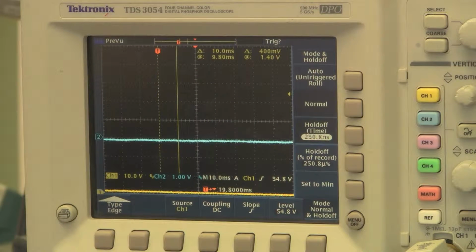I will now be going over the ThunderBox over and under voltage emergency stop tests. For this engineering requirement, we have to be able to detect the ThunderBox exiting its designed supply voltage window of 30 to 55 volts DC and report that on the emergency stop bus within 10 milliseconds.